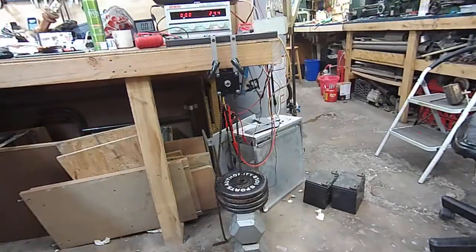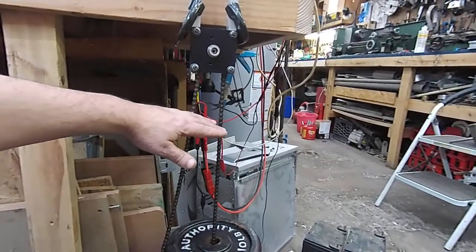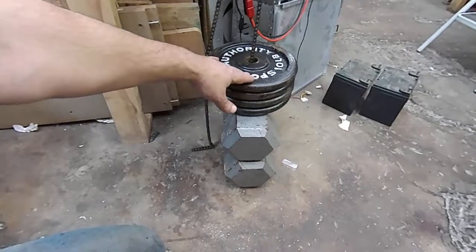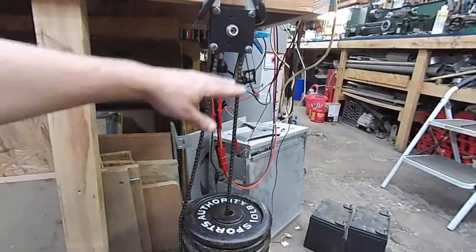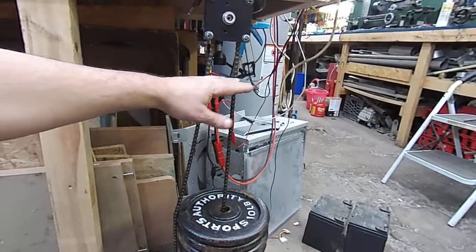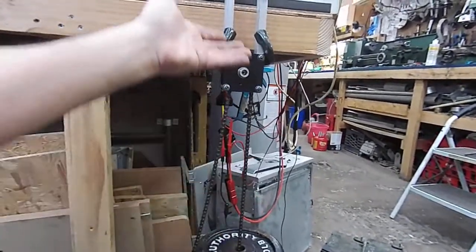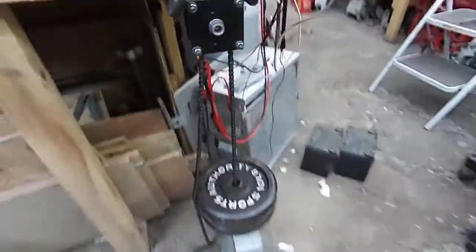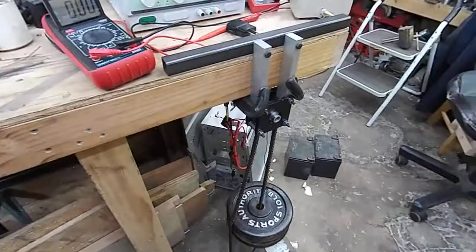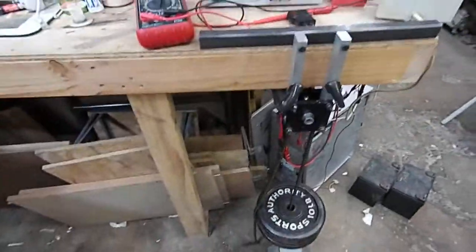There we go — stall current was between six and seven amps. At 10 foot-pounds, or 120 inch-pounds, stall torque corresponds to right around six amps. At seven amps it actually starts moving, and of course the faster you want it to go, the more current it will draw — but it's still supplying that 10 foot-pounds, 120 inch-pounds, or 1920 ounce-inches.